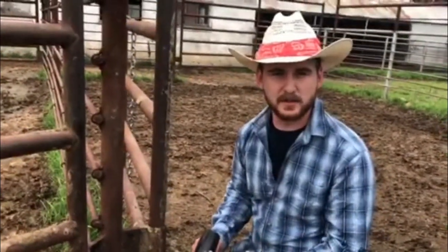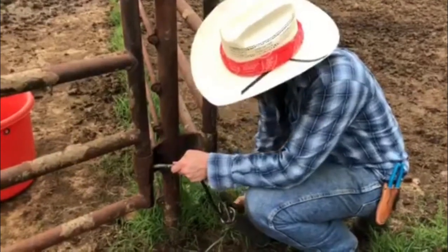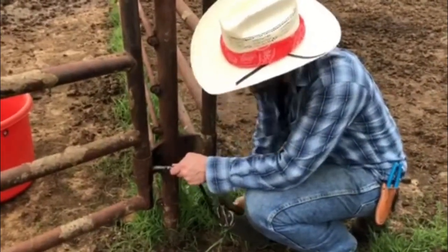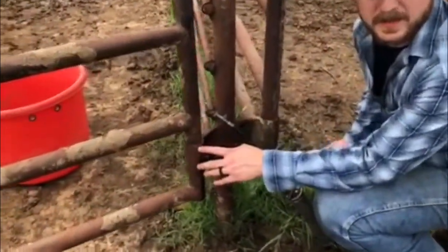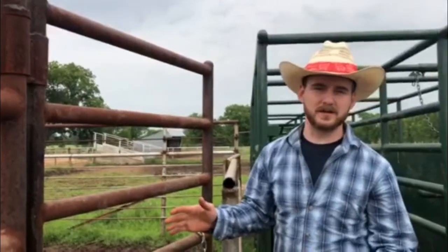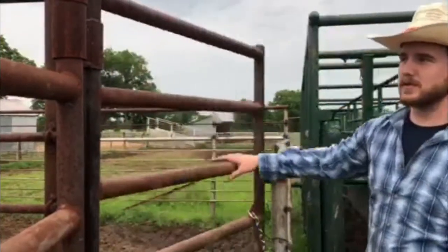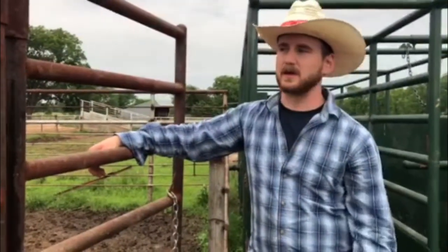That works pretty well. This is going to allow us to put grease through that hole and grease this hinge so these are quiet, smooth gates. Using the grease gun, we're just going to fill this full of grease. You can see the grease has started to come out of the top of the hinge — once we rotate it around and get the grease set in there, this is going to be a smooth, quiet gate. We've got about five more gates to do before we run out of daylight, so we'll quit filming and get to work. This gate is now smooth and quiet — it's going to make cattle working a lot easier, won't scare or spook them, and it'll make our gates a lot easier to swing. Thanks for watching everybody — we'll see you on the next video at Farm and Ranch Hacks.